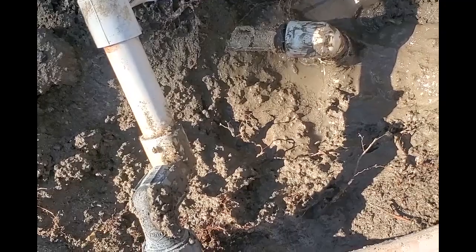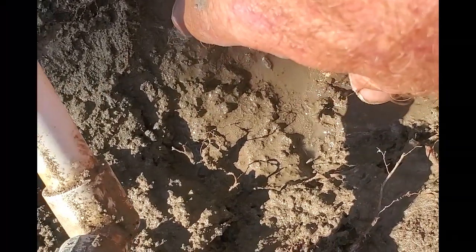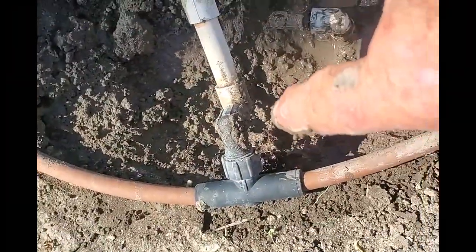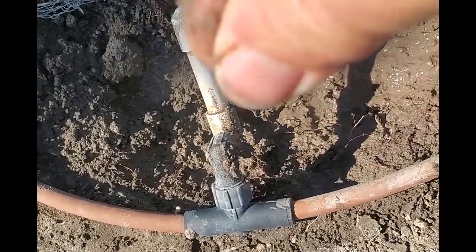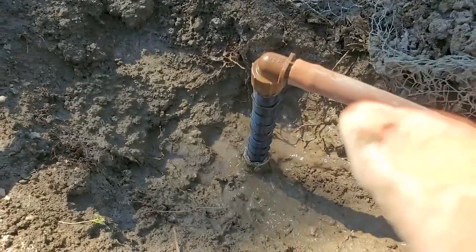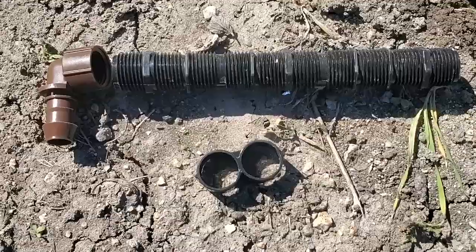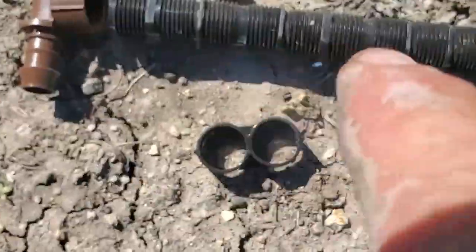This repair on the same property — there's a cut-off riser that somebody had screwed in here and it busted; looks like a shovel went through it. To simplify this, this T situation is unnecessary and it's going to be difficult to screw something back together here, so I'm going to simplify this to the max. Just a cut-off riser, an elbow fit into the tubing, and a figure eight on the end. Got rid of all that junk. All I used was three fittings: this barbed elbow, the cut-off riser, and that figure eight for the end of the tubing.